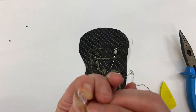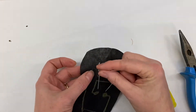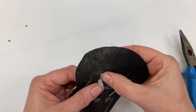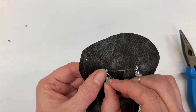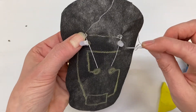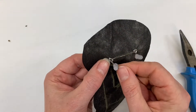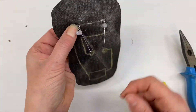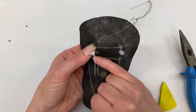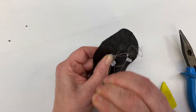I'm just going to make sure the legs are straight and hold that over. If you don't have any thumbnails to hold it on, you can actually hold the leg like that to sew it — I prefer to hold it at the top because then I know it's secure. Don't pull too tight. One of the things you've really got to make sure is you do not wrap the thread around the LED, because if you do you will end up with a short circuit. Electricity is like water — it finds its easiest way back to the cell — and the power will skip the LED and go straight across, so it's really important that you do not wrap the thread around the LED and legs.